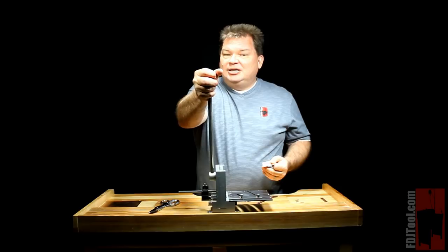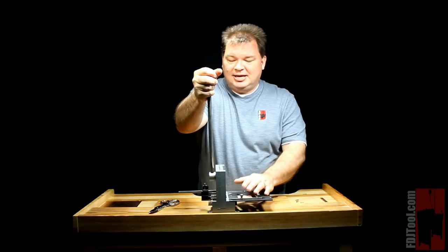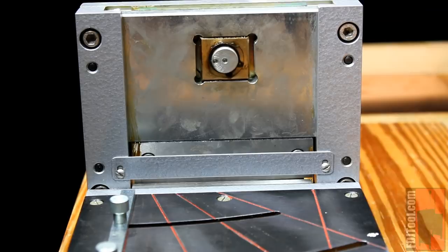When you've got a piece of metal and you want to get a nice, crisp, clean cut on it, the guillotine shear is definitely the tool you want to use. The way it works, just like its namesake — the guillotine — when it slices through metal, the blade goes straight down, giving a nice, crisp, clean cut without deforming the metal.